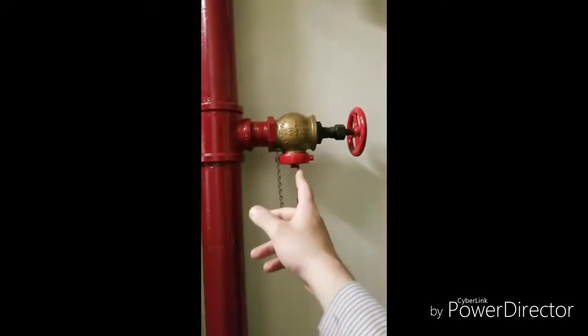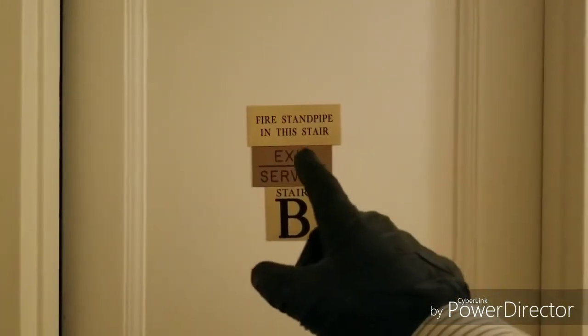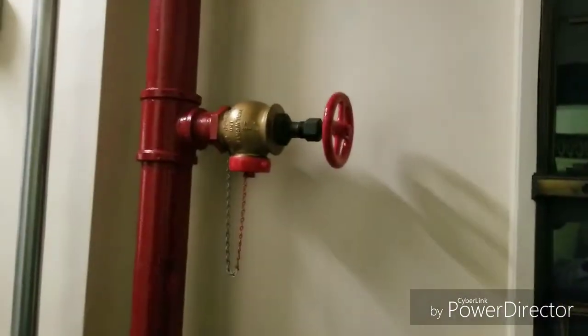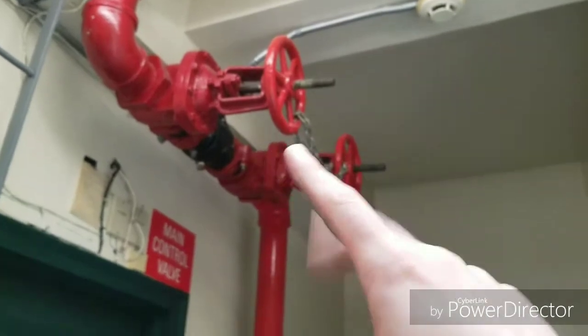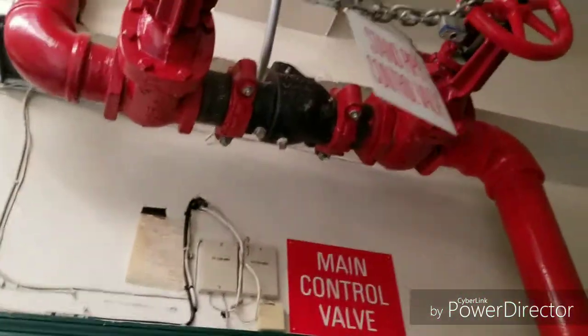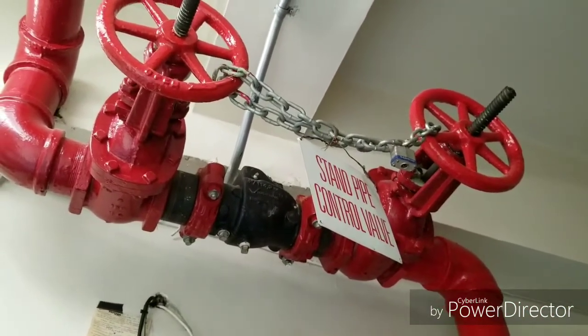The valve comes up and down — you hook your hoses up if there's a fire and drag it into the apartment. All doors must have a sign that says 'Fire standpipe in this stair.' The standpipe comes from the roof tank. There's the main control valve, two screw and yoke valves, and the first hose attachment. It always has to be locked tamper-proof in the open position.